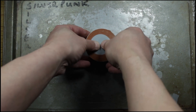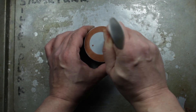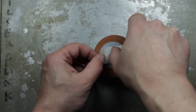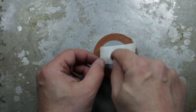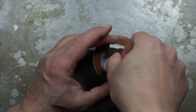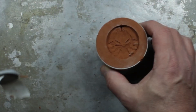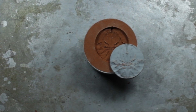Nearly at the time to see if it's worked. I'm giving it a little bit of pressure and a tap to try and loosen it up, to try and get a bit of air underneath so it comes out easier. I'm using the old masking tape again — just grabbing a bit of tape, pushing it on with the back of my nail, and then we'll try and lift it out in one nice movement to see what the impression's like. Oh wow, look at that bad boy! There's the mask. I think now we better get the furnace on and get ready for the pour.